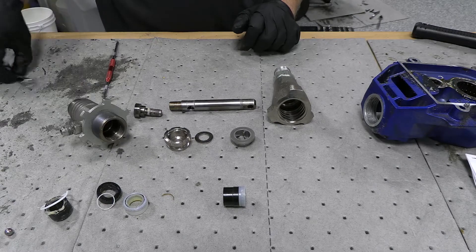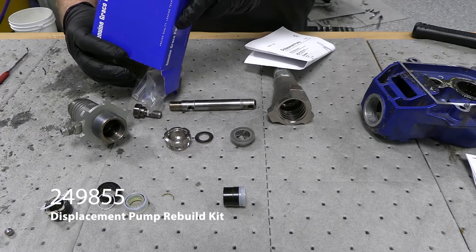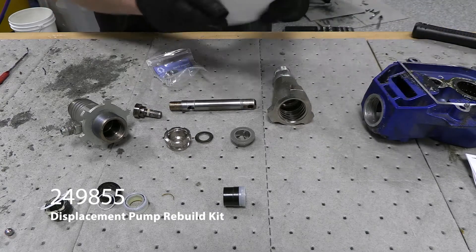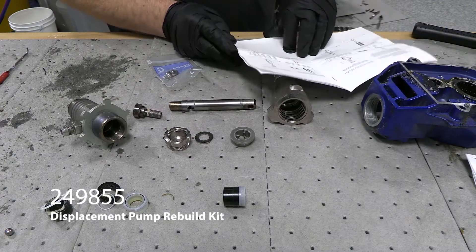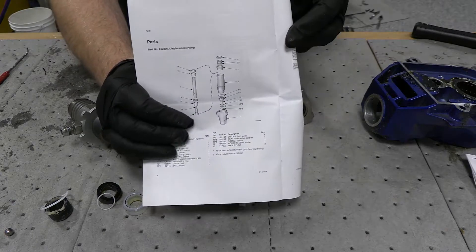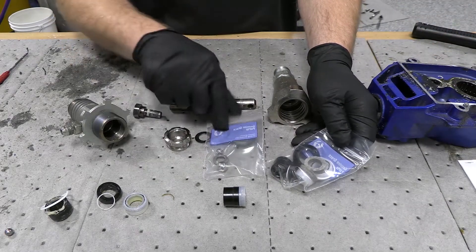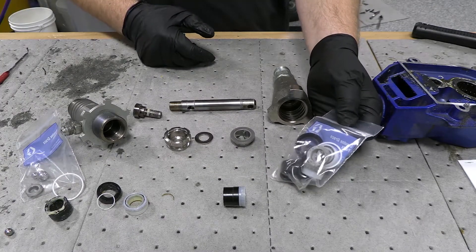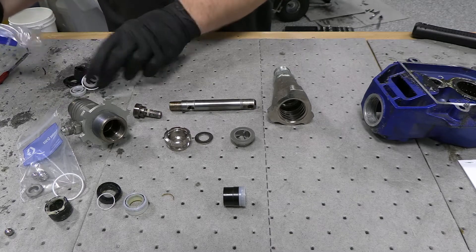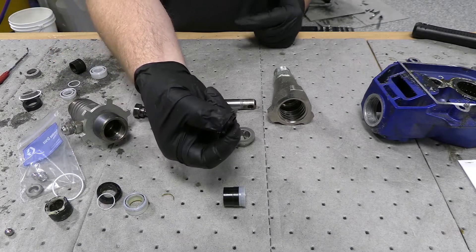So that's it completely disassembled, cleaned, ready to go back together. Part number for this kit is 249-855. Comes with the instructions — if you have questions, it talks about most of this inside of here and it shows you the order in which they go and how everything is stacked inside of that pump and how it should go. So this is what the rebuild kit is — there's your check balls and your seat and the rest of your spacers and parts and your felt packings. This is the black piece I was talking about, that cap that holds the felt washers down, that was just torn to pieces when we started.